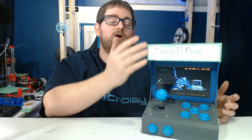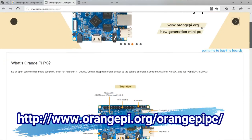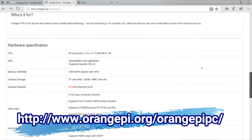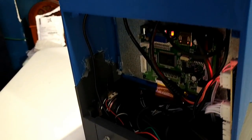I've got a 7-inch LCD, and one of the things that screams arcade to me is to have a lit up marquee at the top. I don't have the artwork for it yet, but I really wanted to make sure I could have lighting on the top and a nice display up there. The entire thing is powered by an Orange Pi PC — a 1.5GHz quad-core board with a gig of RAM that takes a microSD card. I picked the PC version because it also has analog audio out, which makes it much easier to wire up the two speakers. As you can see, I have speakers on the side, and I've wired in volume control into the back. I'm very happy with the audio quality — it's very immersive and exactly what you need for this type of setup.